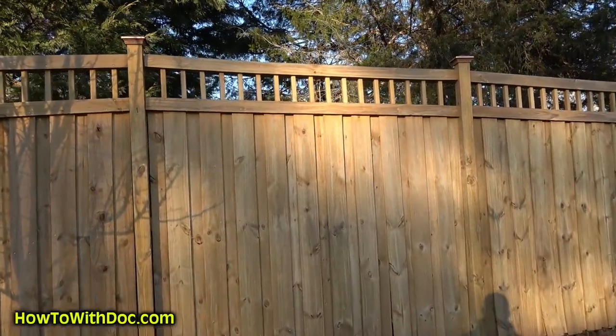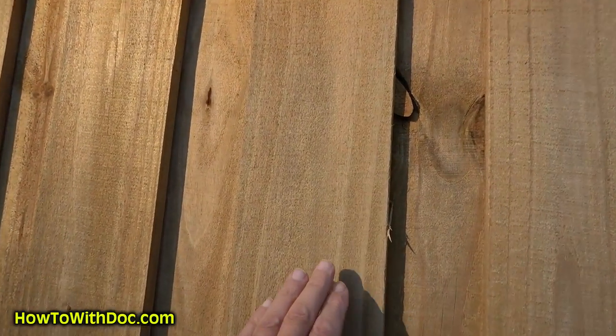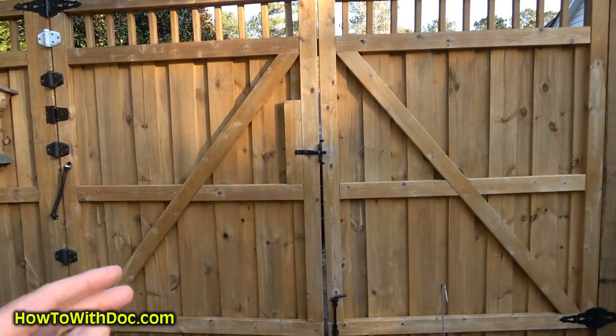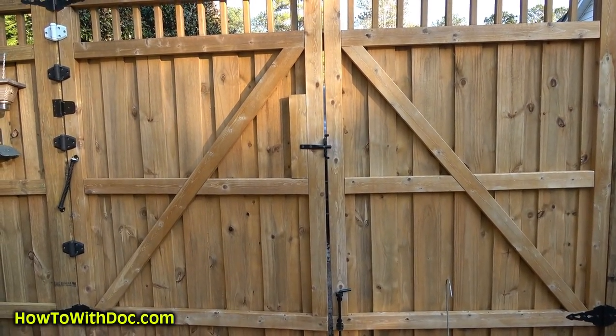This is the cleanest fence — we don't need to get it this clean for what we're doing, but I have to show you this. The wood looks just like the day it was installed. Then we also came over here. These gates for some reason were really heavy, dark grays and almost black, and now they've turned out really nicely, nice and clean. So just remember: when you get that tannin dark color, the gray color, the oxidation, the breakdown of the cellulose — understand the difference between that and that moldy gray kind of color. Hit subscribe and I'll show you the stain.